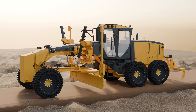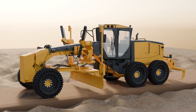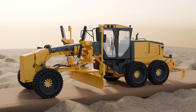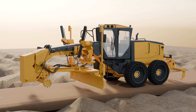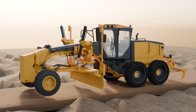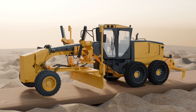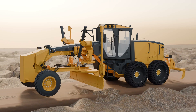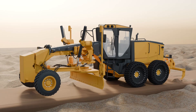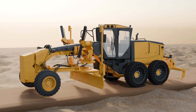The team has a suspicion that the front tires are leading to the bounce in the machine while driving. To isolate this issue, they will remove the front two tires from the grader and reinstall the pneumatic tires. If the bouncing stops, they know where to focus their efforts in developing the next tire design improvements. If there is no change, they may need to start over from scratch. Now we have four of our tires on the rear and the pneumatics on the front, and we're repeating some of the tests to compare.